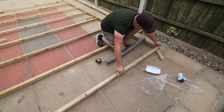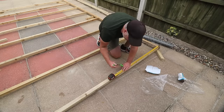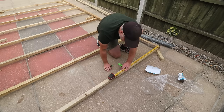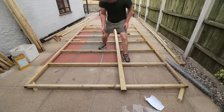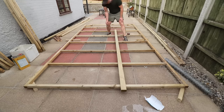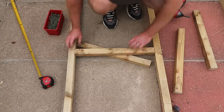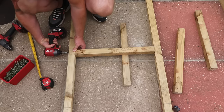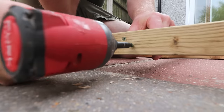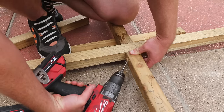I'm going to be using galvanized mesh that comes on a roll, and as it's 900 millimeters in width I'm going to space the noggins in my wall frame so that they give somewhere to secure both the bottom layer of mesh and the next layer above it. Well, that was my plan anyway but things didn't really work out like that — I'll explain why later. After making the marks along each of the uprights I can reuse my spacers as noggins, and I cut a few more at the same length so that I can finish the wall with one in between each upright, which is going to help add rigidity. Most of these screws needed to be toenailed in at an angle.